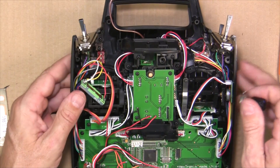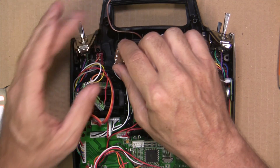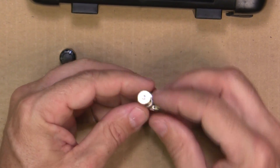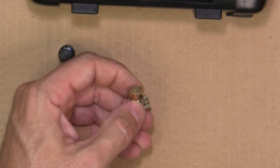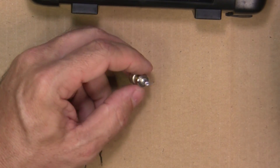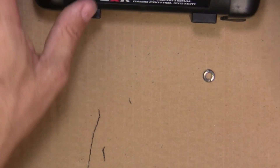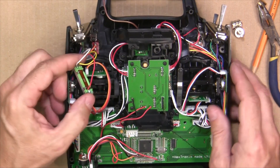I already have my pot removed — it will be right in that little hole down in here. To remove the pot, it's going to look like this on the top of your radio. Pull off the black cap first, which will expose a little brass ring. Use a 1.5mm hex to loosen the hex screw, then use a pair of pliers to lift off the brass cap. That leaves your pot in there; just rotate this little nut, pull the nut off, and push the pot through the radio.